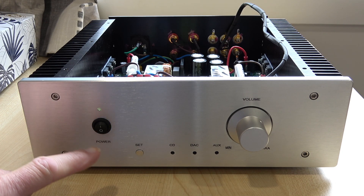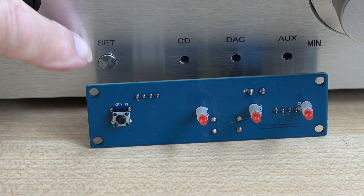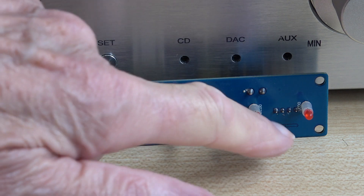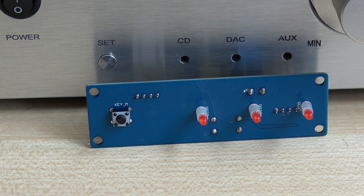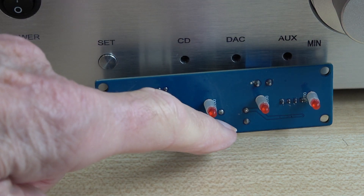If you ever bought one of these cases, it would contain one of these input switching boards. It would have been located just behind this switch, which corresponds to here, and the three LEDs which are here. That would normally be in the front panel. This would have been connected to a relay board in the back of the chassis — you pressed here and it would cycle along and light up one of the LEDs and the corresponding relay. I'm bringing this up because if you've been watching my channel, I've had three or four of these chassis and all of them have the same switching arrangements.